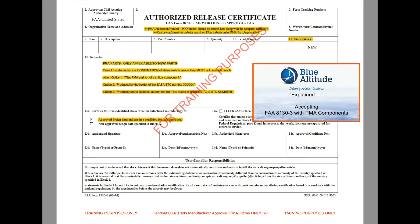So there is some weight behind that. The thing to understand is how would you recognise the paperwork, or that a component is a PMA part itself or has the PMA part approval. What I'm going to do is walk you through this 8130 just so you have a better understanding. If you're working in goods receiving, you'll be able to recognise that this part is a PMA part that may be in your hand or that you're just about to do the goods-in inspection.